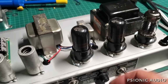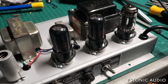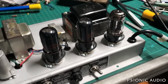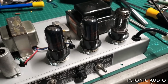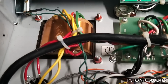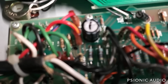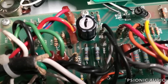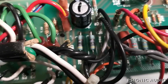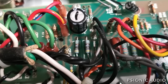It's got these blacked out current production 6V6s that say Fender. Has nothing to do with old black RCAs, but it does make it harder to see if the heaters are working. We'll get there. Let's flip it around and look at the inside. Okay, it's bone stock, and I could smell it even before I got to it. But yeah, both screen grid resistors there are smoked. So something is wrong probably with these output tubes to take out those 2 resistors so dramatically.